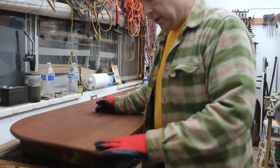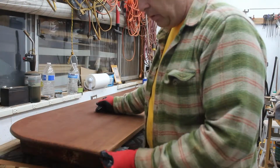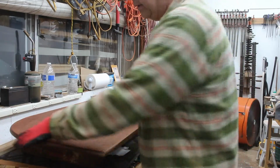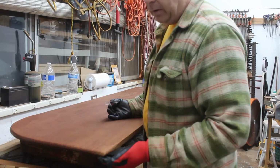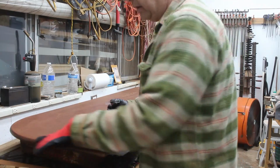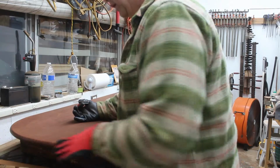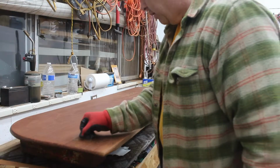And then the bullnose, by the way, I could not find a 3/4 inch round over routing bit that would fit my older 1/4 inch drive router. At least not one that was cost effective. And so I ended up just using a hand planer to get the rough shape, basically planing it down to a 3-sided facet across the curve, and then I used a belt sander to smooth it out further, and then I just hand sanded it to get it to the final shape. The camera probably does not give it justice, but the bullnose and the curve are just so beautiful. I'm really happy with how the whole thing came out.